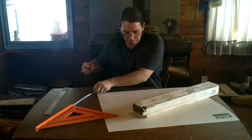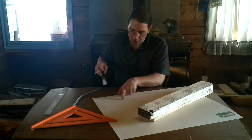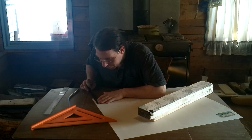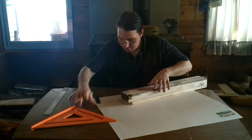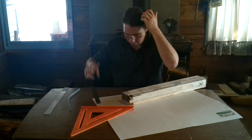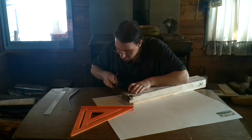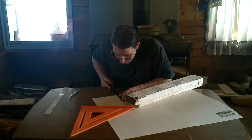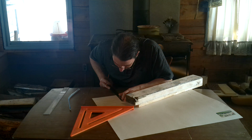Now we'll do the profile on the top. Okay, that's going to come from this bottom set of lines. So this is my top, and that's my bottom profile. So my top profile at the bow is 34. Forgot to strike that line through up top here. First grid line, first station line. These cross sections here are called stations. The first station line, back from the bow, 51.